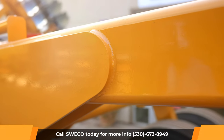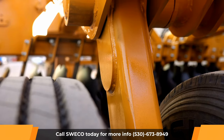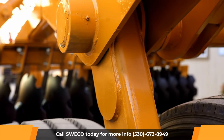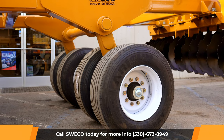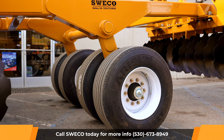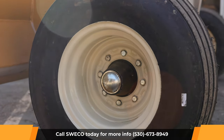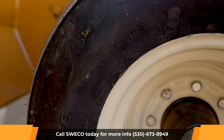The transportation axle is plated with 5/8 inch thick material on each side of the mainframe with plated rectangular tubing. Options for transportation are 10-hole bud with super singles, or an 8 on 8 hub and axle with 12.5L-16 tires.